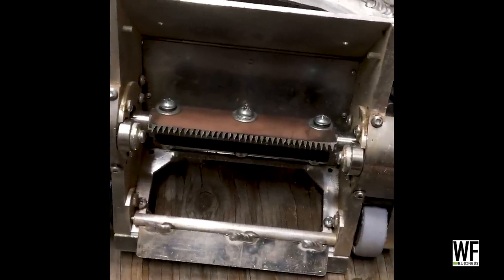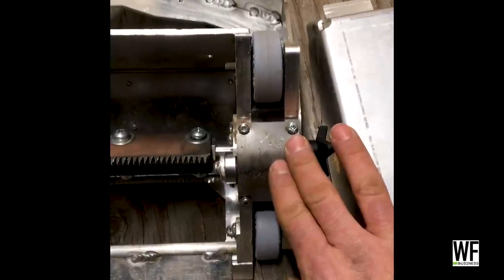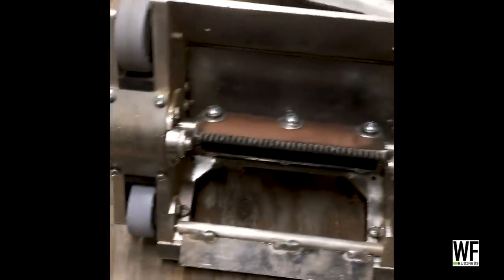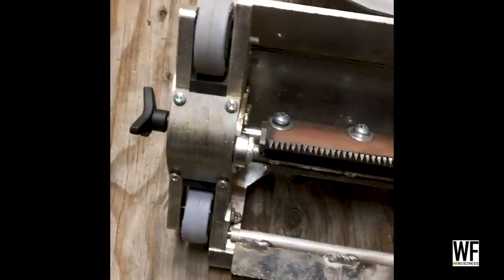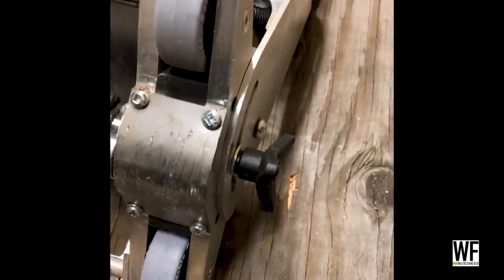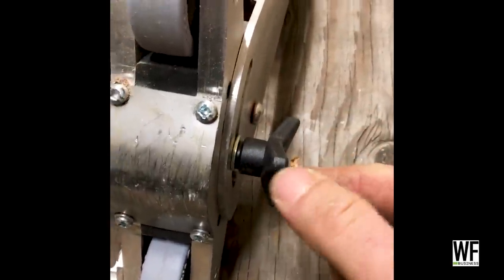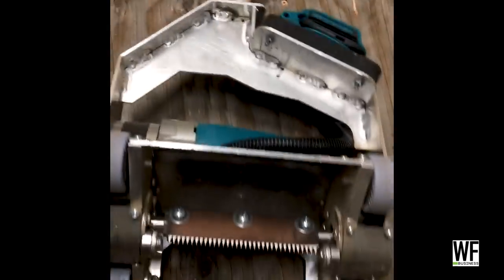In our situation doing flooring, the staples are going to be all over the place. I did notice when it's not able to pull anything off to the sides it does hit and will bounce around a little bit, but it still managed to pull almost every one. You can set the handle angle by turning these two threaded wing screws — I'd probably swap those out for a Torx head or something lower profile, since a wing sticking down can get caught on staples. Made in Canada, so I'm assuming metric. Nice that it runs on the Makita 18-volt platform.